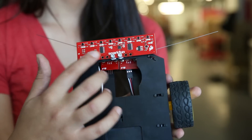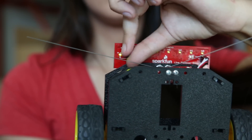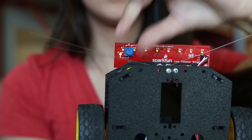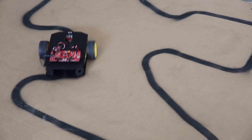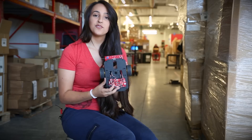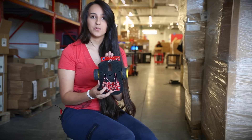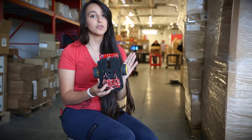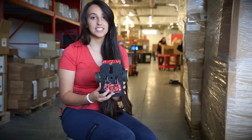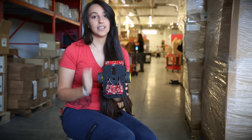The array itself has eight IR sensors. It's really nice because it's got this potentiometer which will turn up or down the sensitivity of the IR power, which will allow you to follow lines in any type of lighting situation. Another cool feature of the line following array is that you have lights up here which kind of show you what's happening and what it's sensing, so it's really easy to debug and see visually what's going on inside the board.